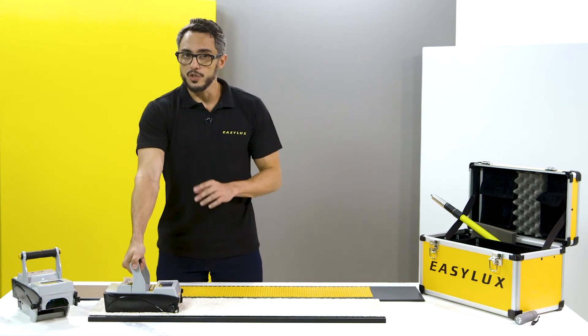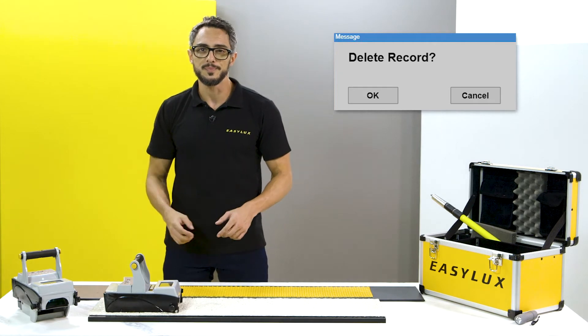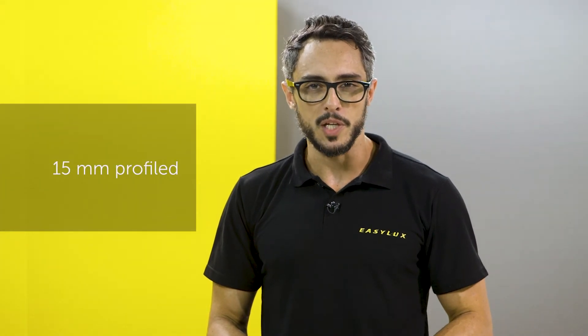The Mini has optical arrangement B, which brings great stability in case of small inclinations that are inevitable in fieldwork. Hold the trigger to delete a measurement and try another position free of interferences. The entrance angle is only 1.24 degrees. To implement CEN 30-meter geometry, the Mini, as any retroreflectometer, needs a plain surface. For profile markings, no problem — the Mini works with up to 15 mm elevations.